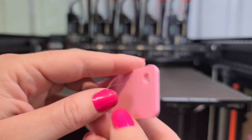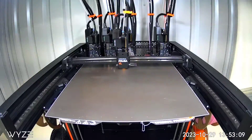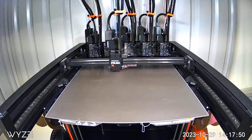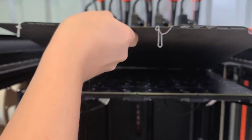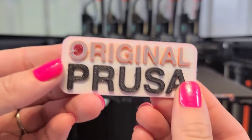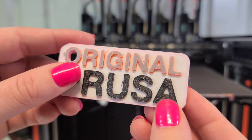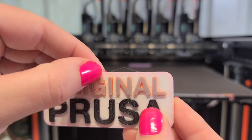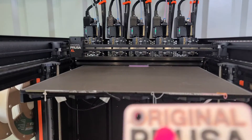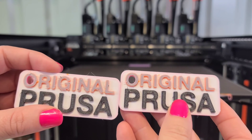This one didn't have the black string smear into the first layer. I get the print at 210 going. There was one little purge line it dropped, but other than that it already looks much less stringy. I think this one turned out much better. Any stringing seems small, like it will pop off. It's not perfect, but it makes me want to try a longer, more challenging print. Would you keep trying to fine-tune this print, or would you try something more difficult? Thanks for watching.